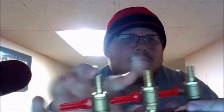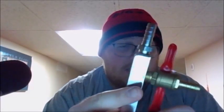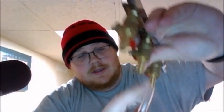So CO2 tank outputs into the switch. This right here is where CO2 is coming in. CO2 will go out of here and into the keg. So a 1 to 3 switch is needed for my 3 faucet kegerator. The CO2 line is this. You need this special white connector here to connect to the keg. Regular tubing that I got from a home brew store. So this goes in, connects here. CO2 connects down through here to the keg.